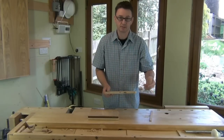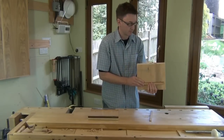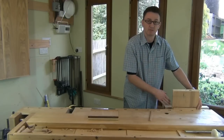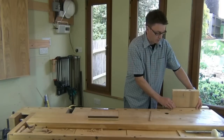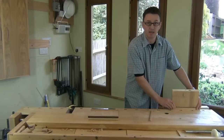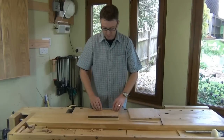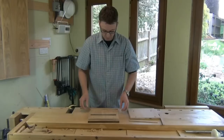These two shorter battens will just attach to the outside of our saw vise, so that if we are using it in a bench vise which doesn't have a screw to stop it falling through, or to stop it falling to the ground — for example if you have a leg vise. So the first thing we need to do is attach these thinner battens on the inside of our vise boards.